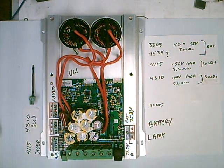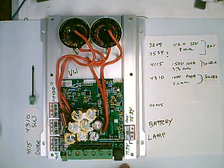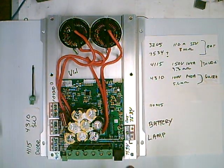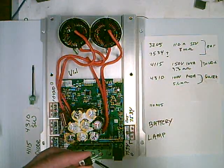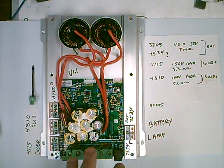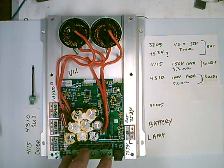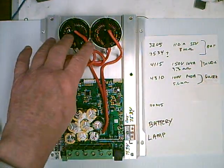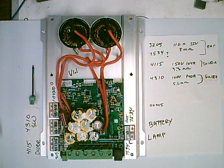These are 3205s — 110 amp, 8 milli-ohms. It could be lower, but if I was ever going to use this for 40 amps I would put a second FET in parallel, because really you can't put that much current through a single pin. In a D-pak you use the thicker section, but 40 amps is a lot of current through a single little device — it would be better with two in parallel. If you're buying a 40-amp controller and don't want it to burn up, derate it to 20–25 amps, maybe 30 on a really hot day.